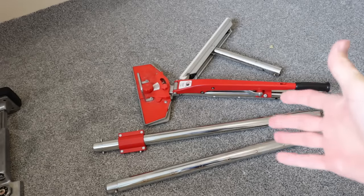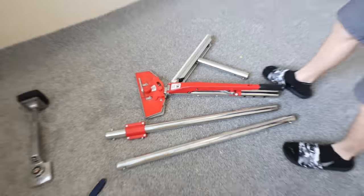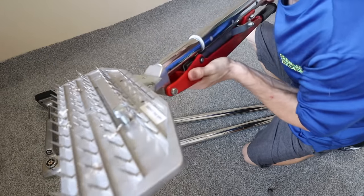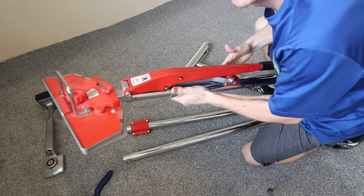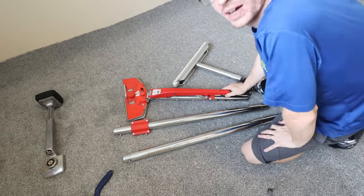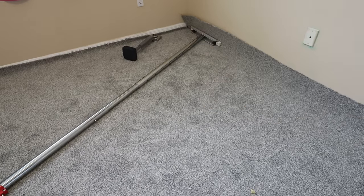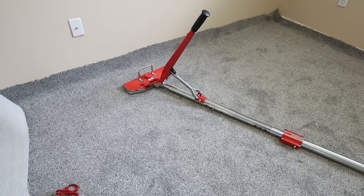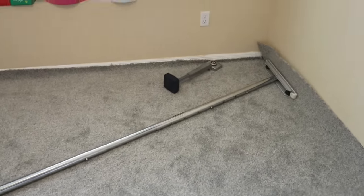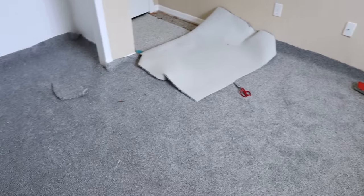So there is your power stretcher. This tool goes with the poles from one end of the room to the other. The business end right here — pretty dangerous, so you've got to really respect this tool. You basically have a mechanism that goes from one side of the room to the other and helps you stretch the carpet when your knee can't possibly do it. I have knee-kicked and tucked in that corner with my tucker tool. Now I'm going to go to this end and stretch it, going all the way around the room. If you don't have one of these, you're left with just knee-kicking the rest of it.